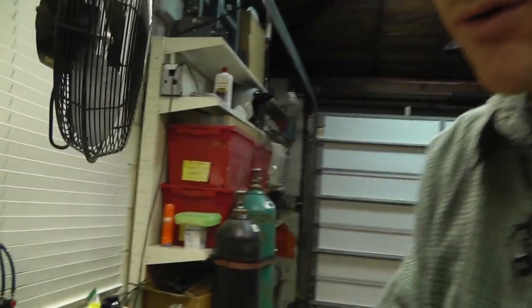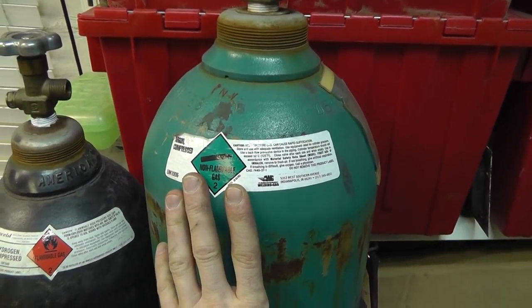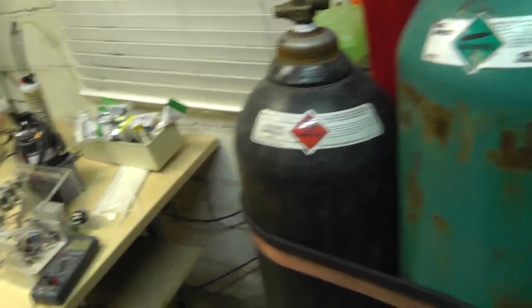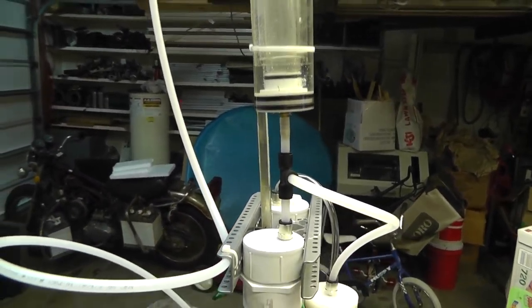Now what I'm actually trying to do here is determine what different burn rates do different things using the gas gun, using ambient compressed air, such as this device down here, which I've used in my previous video, and also things such as recycled exhaust gases or argon or CO2. I'll be using some argon, I think. It'll work the same. Got my control hydrogen here so we can really see what's going on, but to be honest with you, this device produces pure hydrogen besides a little bit of the electrolyte that comes off of it.